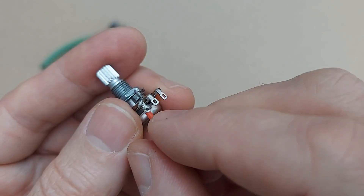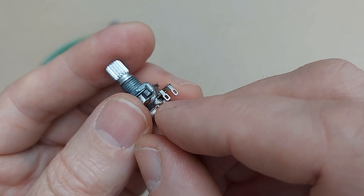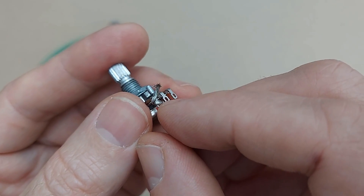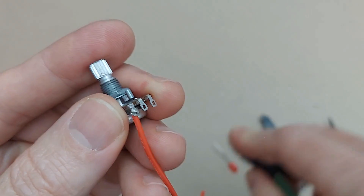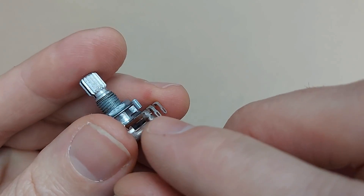I would strongly suggest using some heat shrink. Tape is usually not a good idea — it tends to just fall off — but a little piece of heat shrink would secure this. You could also use a bit of hot glue. Once it's wrapped as tightly as you can, come in with the cutting pliers and trim it so that there are none of those loose wires hanging around to cause trouble.